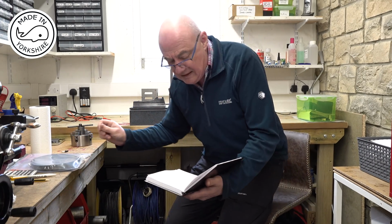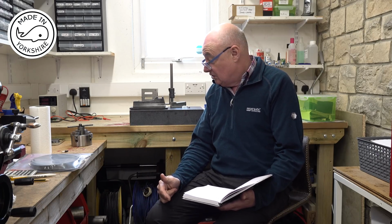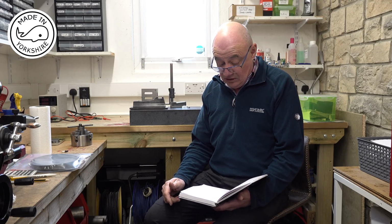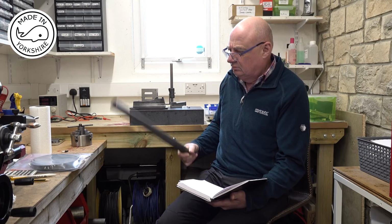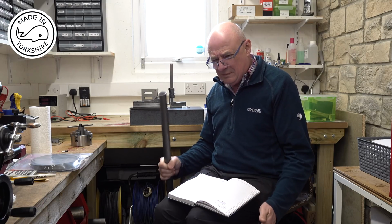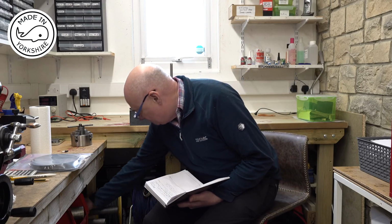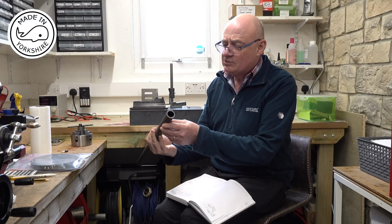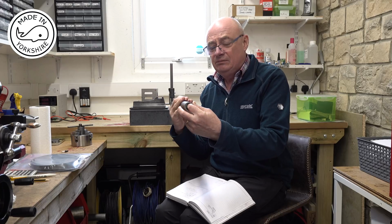And in this video I'm going to be machining the cylinder sleeve and the piston for this odds and ends engine. Now, a while back when I was machining the cylinder sleeve for the Farm Boy, James Chaff suggested, rather than going through all that hassle of between centre boring and stuff, to use something called CDS, which is cold drawn seamless steel. At the time I thought I'd buy some just out of curiosity, and I got a piece. It does look really good on the inside, really consistent internal diameter, but unfortunately it's a bit on the large side. So what I've been waiting for is another piece, so that's just arrived today. In this video I'll be machining this down and explaining why I've gone for this particular internal diameter.